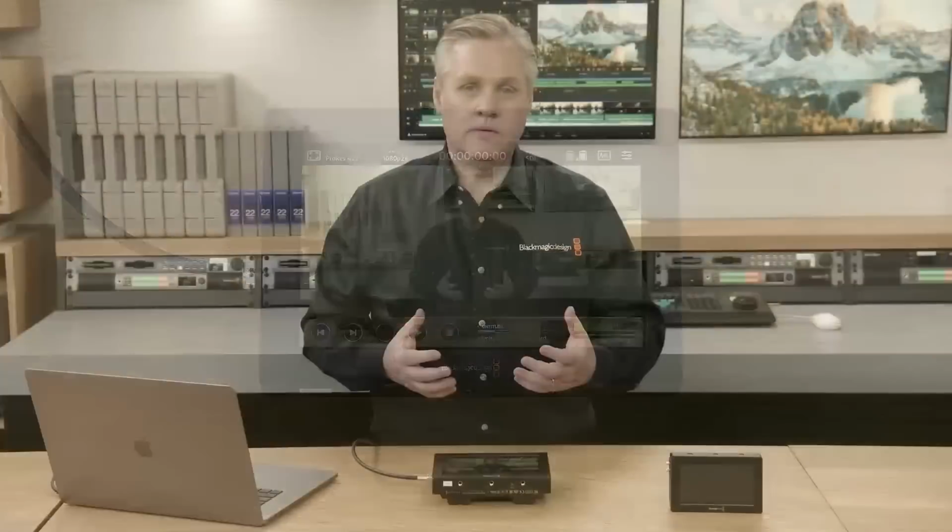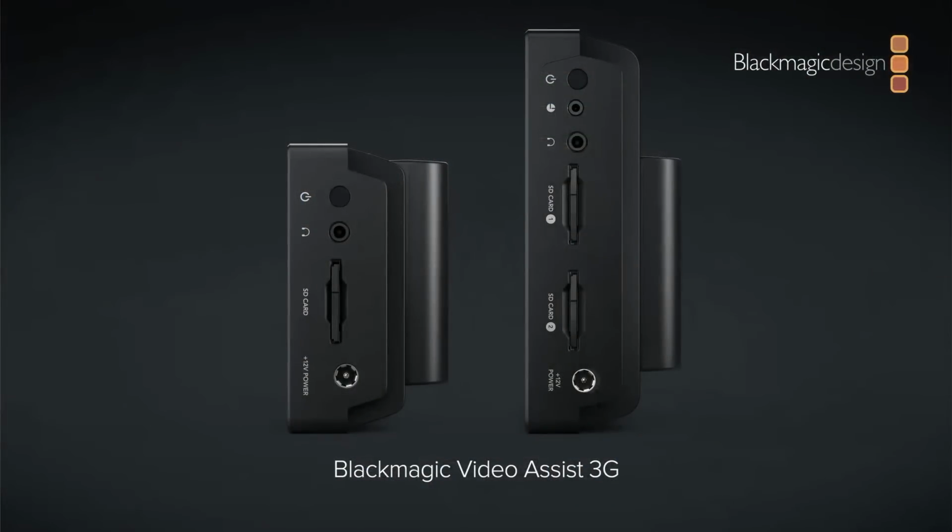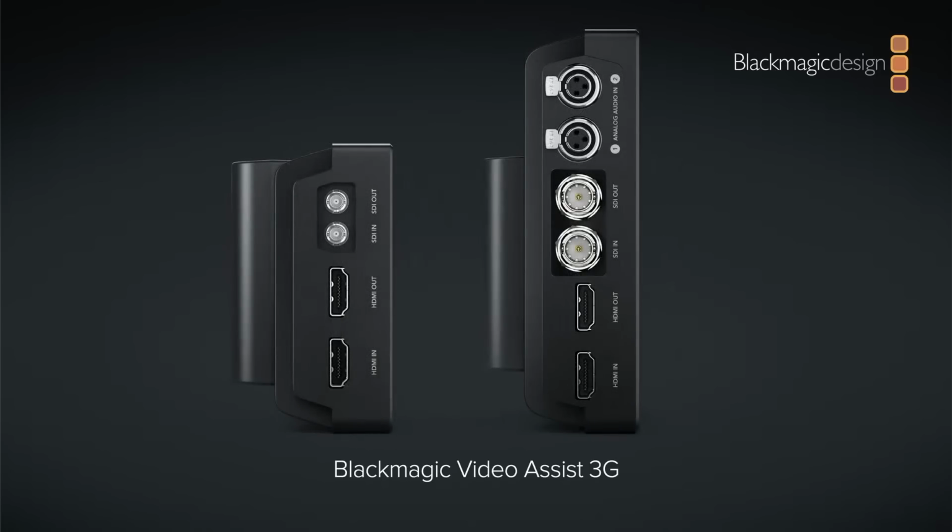We've got scopes, waveform, RGB parade, vector and histogram scopes, and it does ProRes and DNX recording, so it works with any edit software. The 7-inch model has dual cards. You can record continuously and change the cards while you're recording. They've all got 3D LUTs. They run the Blackmagic OS. They've got touchscreen controls, user presets, and all the overlays. They've both got HDMI and SDI in and out, so they both do everything.